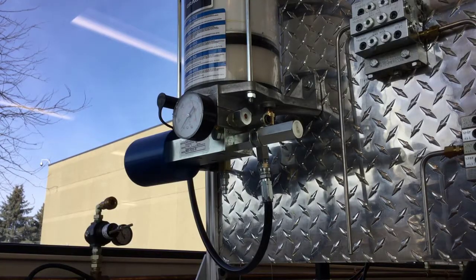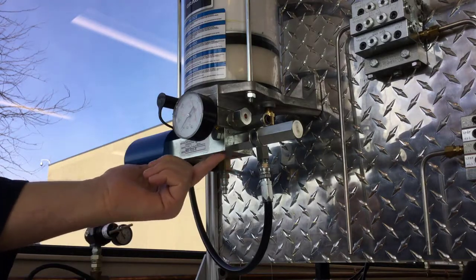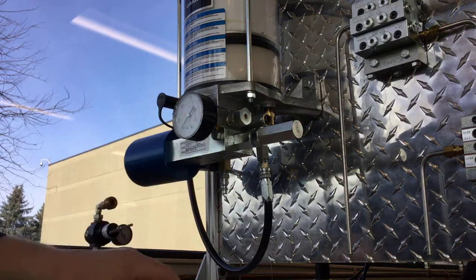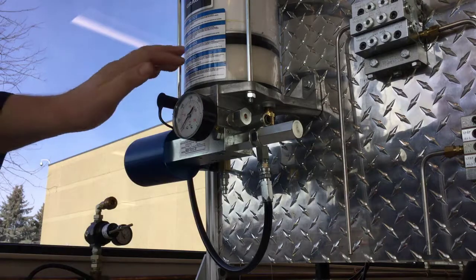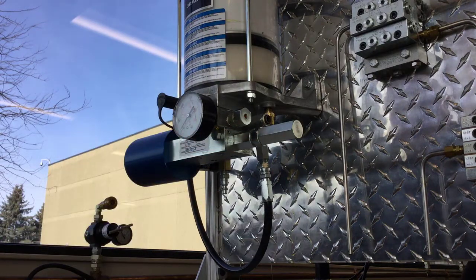Module Flow pumps were designed to be easy to replace. The main tool you'll need is a 3/16 allen wrench. There are four screws that mount the pump to the base plate manifold. The base plate manifold actually has a flapper valve inside, so once the four screws are loose you can drop it off quickly - the pump body is what holds the flapper open, so when you pull it away quickly the fluid flow will stop. You don't have to empty your reservoir every time you change the pump. A 3/32 allen wrench may also be necessary to open the bleed screw.